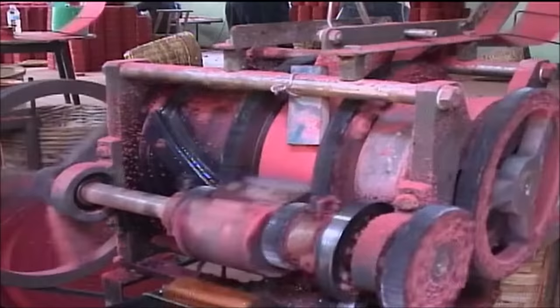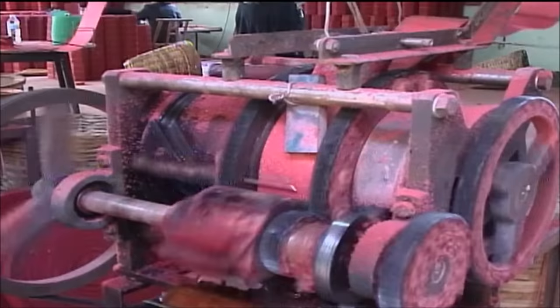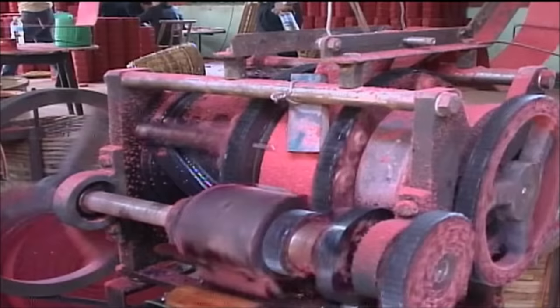The machines themselves are of a very clever design and can roll tubes from an inexpensive, low-grade paper. Tubes are formed in a continuous process as the paper feeds into the machine. If you watch closely, you will see in slow motion a series of metal mandrels being extended by a cam track into the path of the red paper. A rotating brush applies a small amount of thin glue to the paper. Simultaneously, the paper is being cut and continues to wrap around the mandrel.